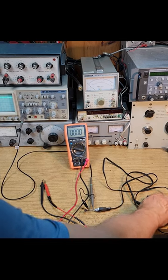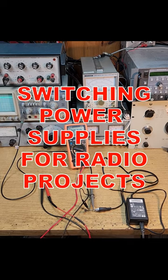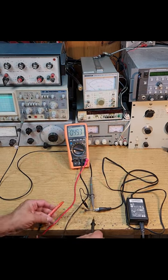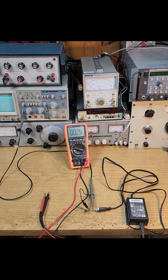We are looking at a 30 volt power supply. This is one of those switching power supplies that probably puts out 300 milliamps or so, maybe more. I've got a 1k 2 watt resistor on that, so the resistor will get warm. We've got just about 31 volts — looks good. Nice DC coming out of there.